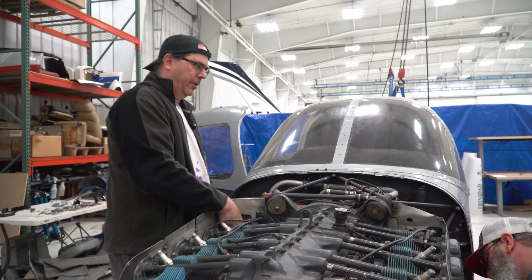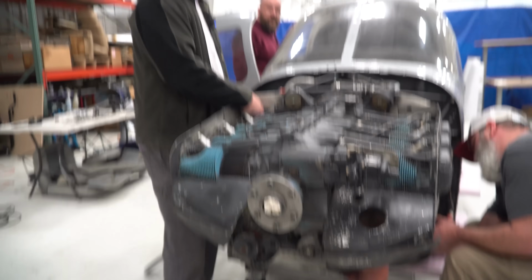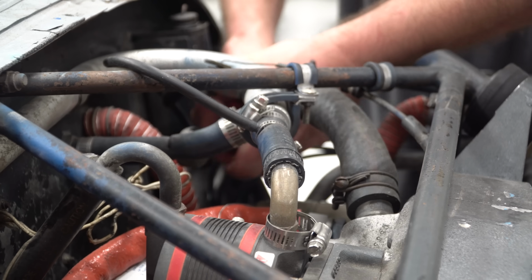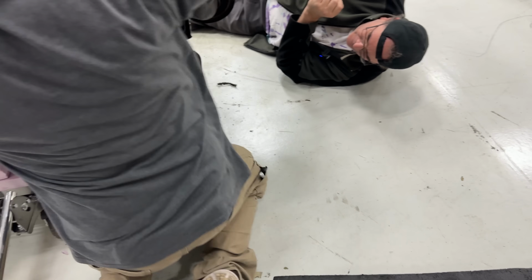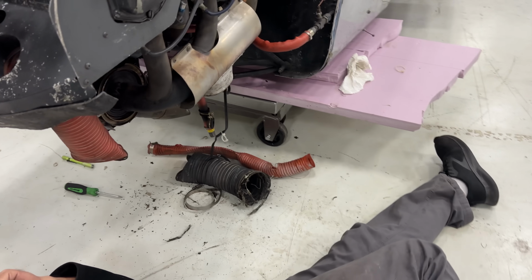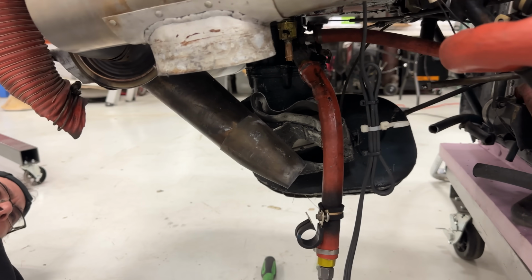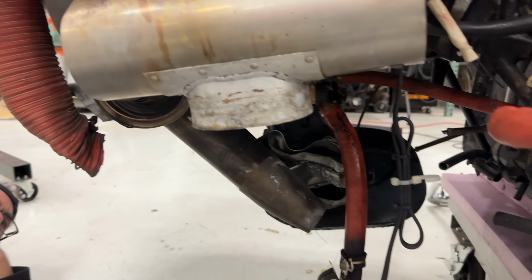Forget what airplane it was in, but it crashed. And it looks like it was low power. It has the blades bent completely underneath the thing, and you can physically see the crank is bent. It bent it that far. I'm literally looking over here. Bent, smashed. Bent, smashed. So pretty much like you'd assume any airplane that decides to land in the soft grass and get the front end stuck in the mud and fold under. Nothing alarming. It looks like the air box is definitely smooshed. Exhaust is definitely smooshed. Exhaust is probably sheared here too because it bent it back.